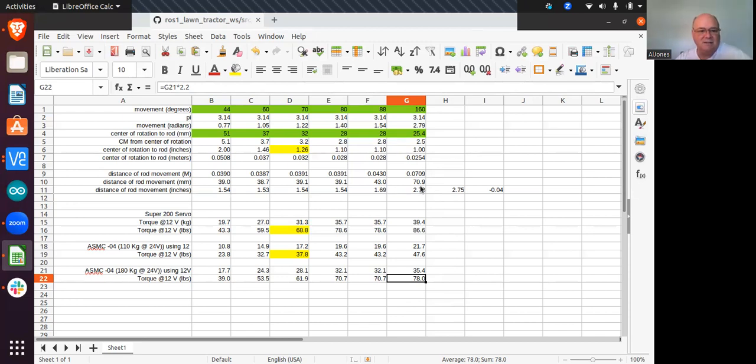I can get some consistent speed, and then test again and see if that, well, and in addition to that, write a program to publish my LoRa status, because I don't have LoRa status in my bag file, so I can't really check post-test whether or not my LoRa was failing. But the more I think about it, the more I think it's my transmission or super servo over current, I guess is probably more accurate. Over current protection kicking in.